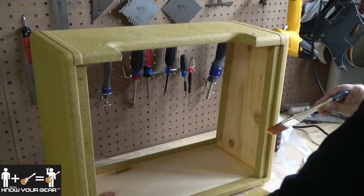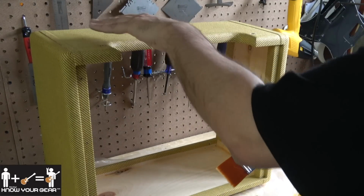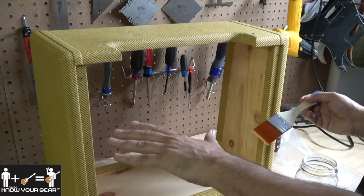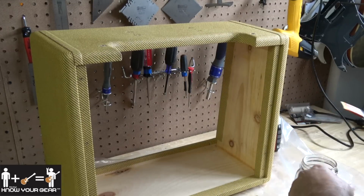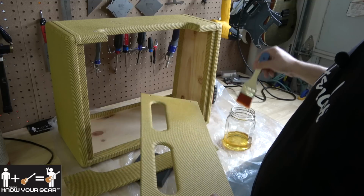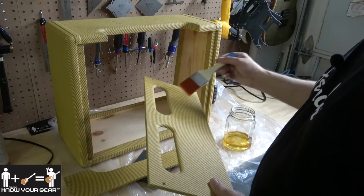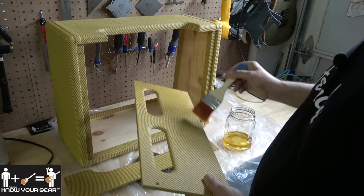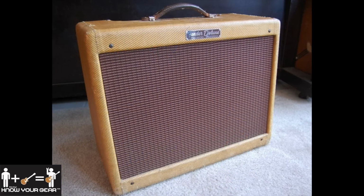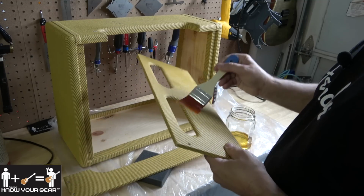And the other great thing about this is, like I said before, let's say you did a spot and it got too thick right here somewhere. Remember, you can just use some alcohol, thin it back down, or thicken it back up. You're in control. It obviously has durability issues. It's not like polyurethane. It doesn't last forever. It's not caked on like a candy coat, but that's also why it yellows and it changes. There's some beautiful things about these lacquer and shellac finishes, in the way that they patina and the ease of working with them.